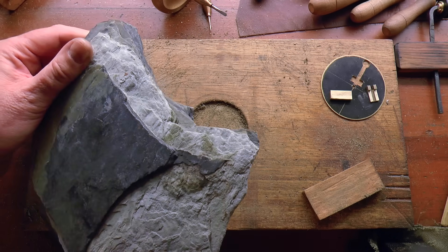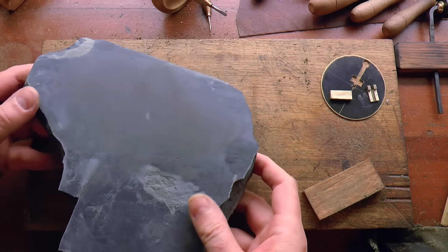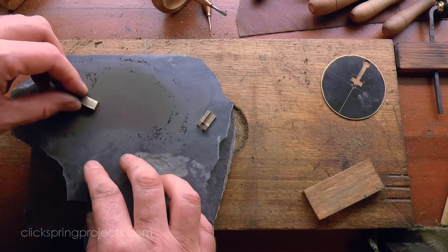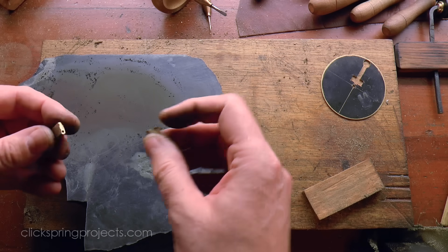On this occasion, much the same requirements apply. The work must fit well together, have a suitable gap within which the solder can flow, and perhaps most importantly of all, the surfaces to be bonded must be free from oxides.